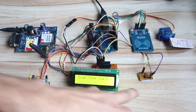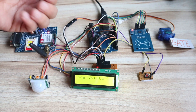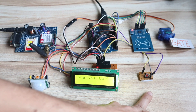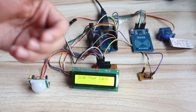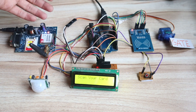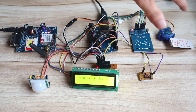Now, what is the use of this switch? The switch is very important. If the valid person scans his tag, enters the house, and then movement is detected, the device will continuously send messages like 'someone is in the house.' If you want to stop that message and stop the security system, you can press this switch — pressing it deactivates the security system. If the user wants to go back outside, he presses the switch again to reactivate the security system. The LCD is used to display messages like 'scan the card' or whether the security system is active or not.